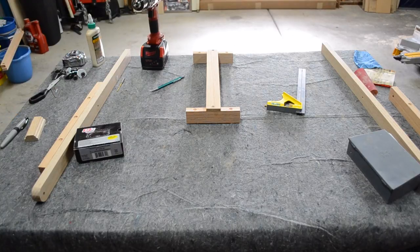Because this wood, when you buy it, it's not always the same size. I've noticed it's about a sixteenth off just about every single time. So give everything a good sanding, put it together, give it another sanding, and then we'll be ready for stain and the finish.